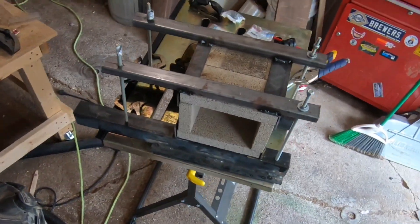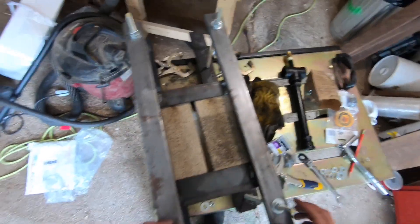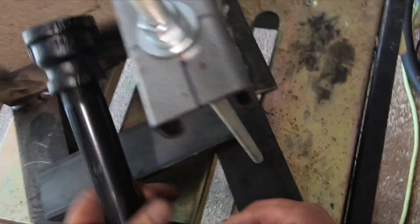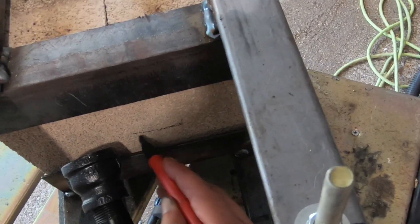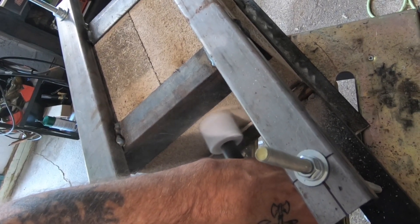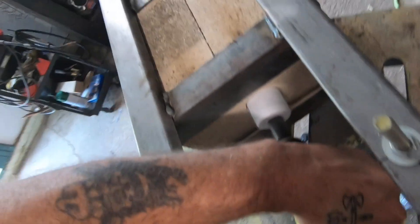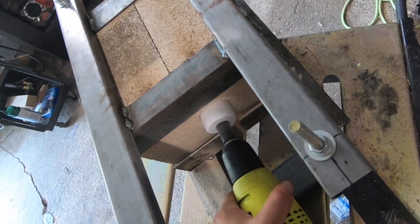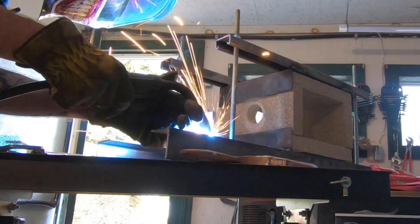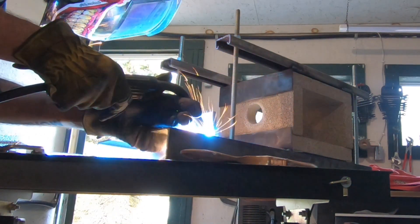Right here I'm going over everything and fixed that gap at the top of the bricks. Speaking of bricks — make sure you get fire bricks. Don't go get regular bricks because there's going to be moisture in them, and once you have such high heat it's going to explode and mess you up. Do your research, go online, watch other videos. Right now I'm drilling out the hole for the burner and then welding a plate so I can keep the burner up a bit and secure — so it won't fall out.